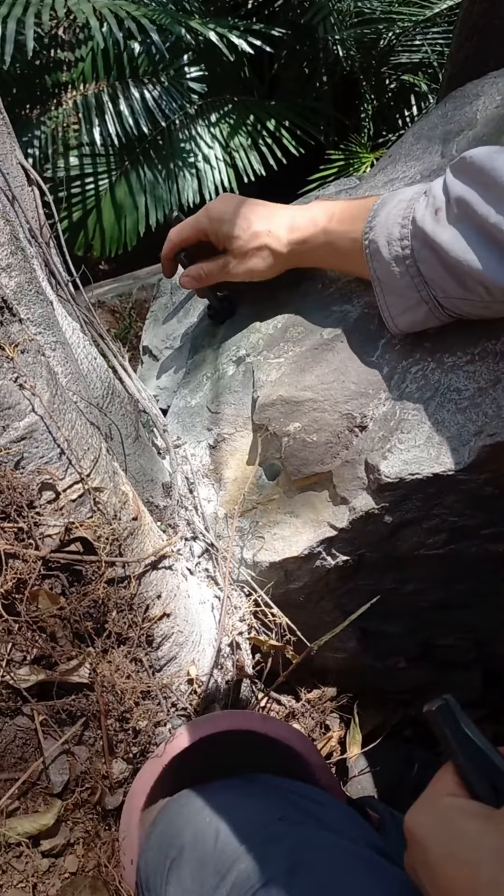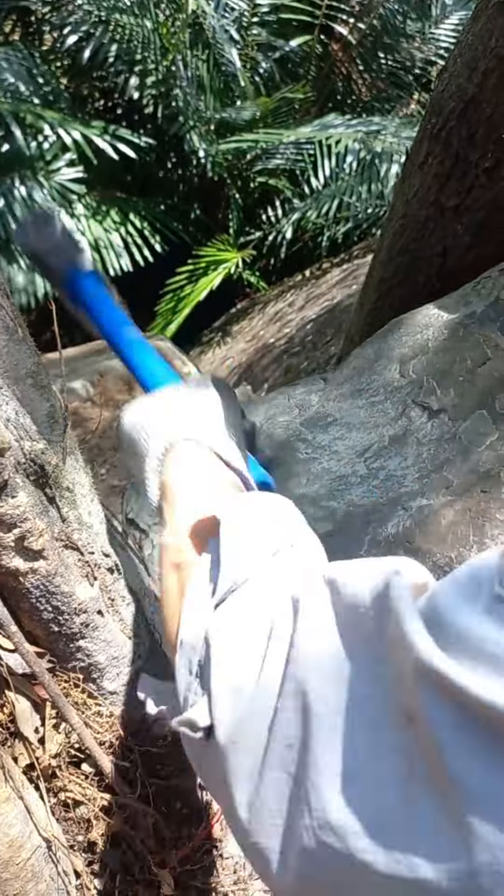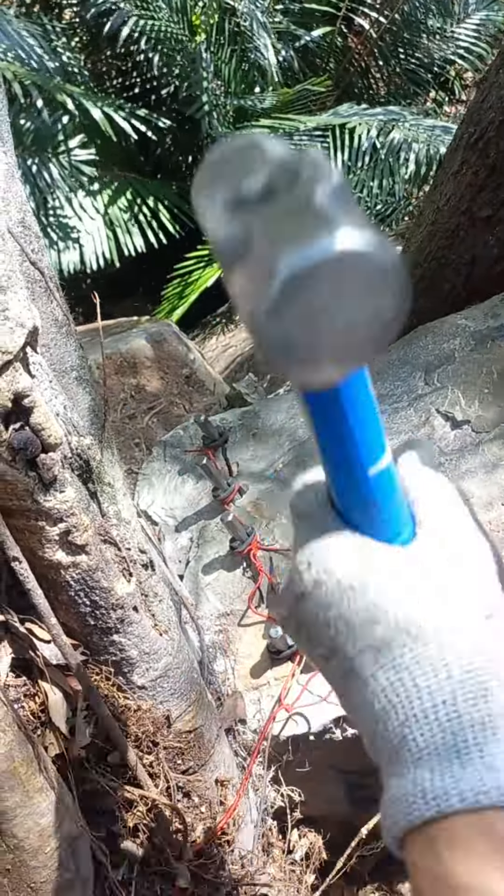Next I insert the splitters. I'll back the wedge out a little bit from the shims so they can be placed full depth into the hole. Next I'll hammer the wedges in back and forth until I see the rock has split and there isn't any more expansion. Then I'll remove them.